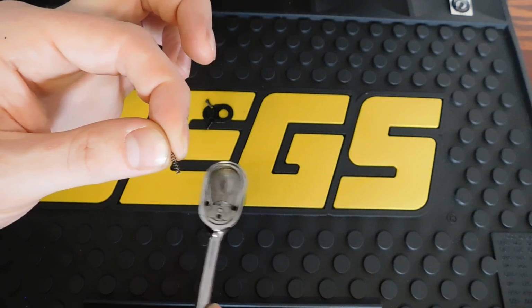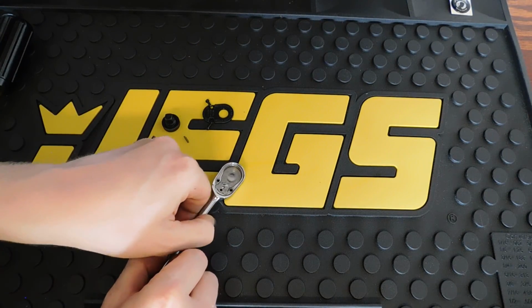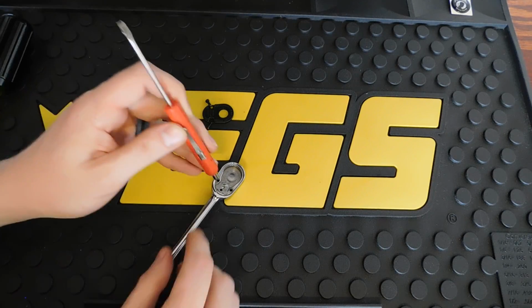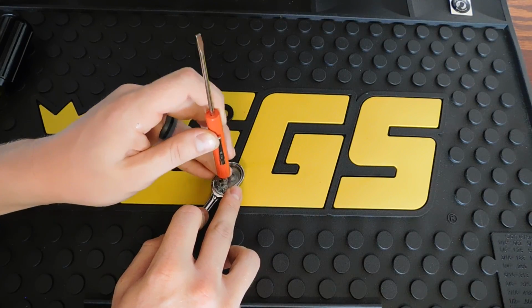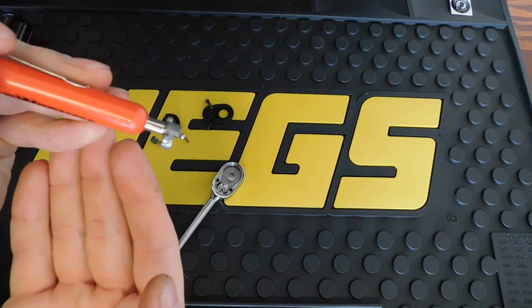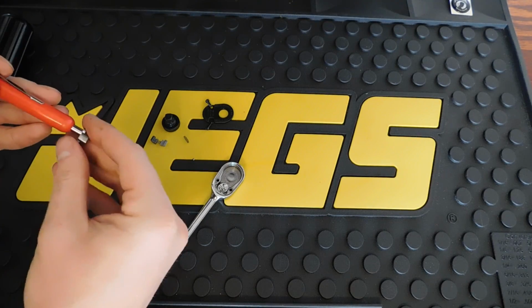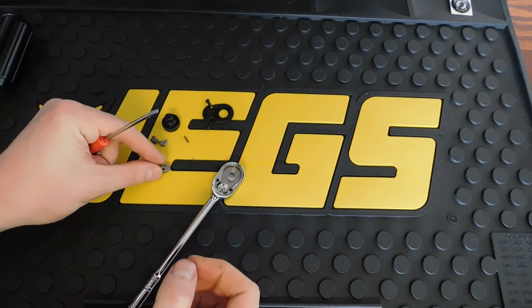These pins on the bottom will be facing down, and then here you have a spring in this spacer plate. You can remove that small spring, and then what you have sitting here is actually a spacer plate, and you might need a magnet to get this out. Now be careful, because in the bottom of here there is a ball bearing. Here you can see it's attached to the spacer plate, so I'm going to go ahead and grab that and set that there,